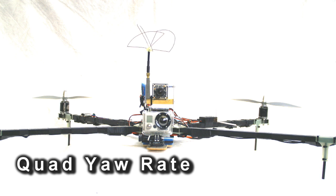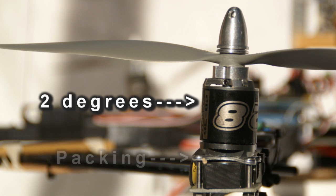One of the big weaknesses of a quadcopter, particularly a large one, is its yaw rate — it can be quite weak. To improve this you can add a couple of degrees of angle to the motors: motors one and three angled in one direction to amplify the yaw response when they speed up, and motors two and four angled a couple of degrees in the opposite direction. This can improve yaw control considerably.